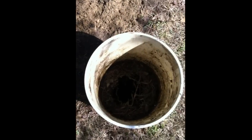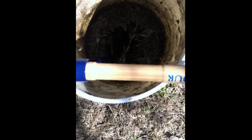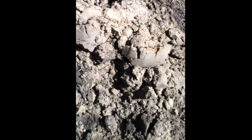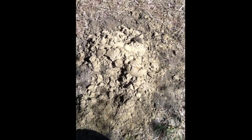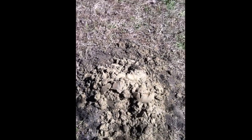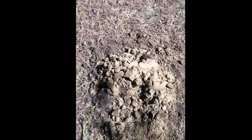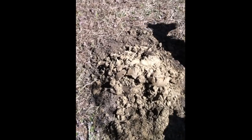We are already through the topsoil at just a couple feet — about three to four feet down. Look at how it's changing color: it went from dirt to clay. It did rain recently, so we're going to go real deep. You're going to go through the topsoil layer, then the clay layer — where there's gravel and clay it'll be wet. That's your actual water layer. Once you get through that layer, go a couple more feet down and you're not into water anymore — you're into harder dirt.